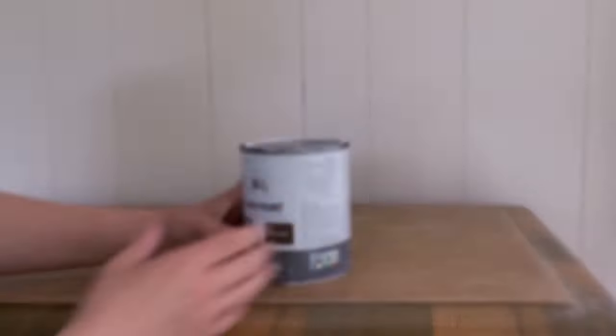As I've seen on YouTube, many furniture artists use the chalk paint straight on the piece of furniture without sanding it, and they mentioned that the chalk paint goes on any surface, so I wanted to try. I tried only on the front of the drawers, but when I went to apply the second coat, I felt that the paint underneath was moving and leaving some patches. And so I chose to actually sand down all the pieces. When I went to apply the first coat, it felt that the paint was actually gripping much better on the surface.